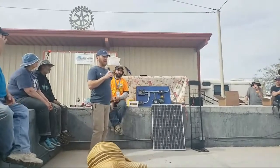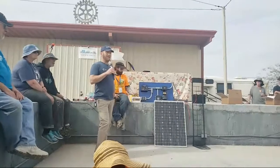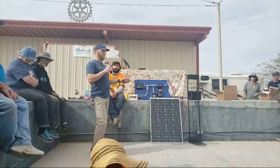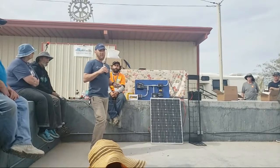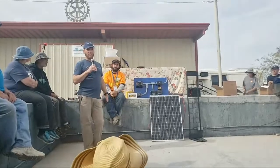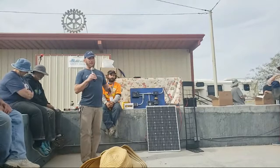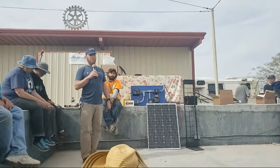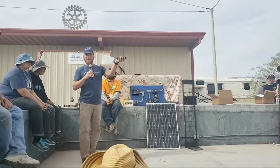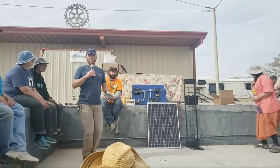Maybe your carbon monoxide sensor, or the leveling pumps, which I've heard can draw a lot of power, or your radio receiver. Another good thing about having a little bit of solar, it doesn't have to be a huge system, is it's always going to keep your batteries in tip-top condition. Most of our controllers can also maintain your starting battery independent of your main battery bank, providing up to 2 amps. That way when you're sitting in storage mode, you're also offsetting the monthly self-discharge of your starting battery. So when you start the car, whoa, I'm running.